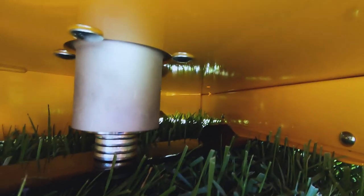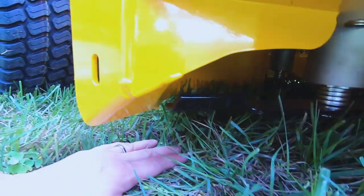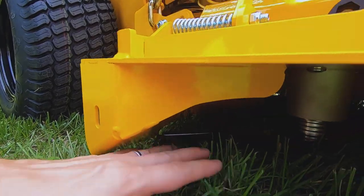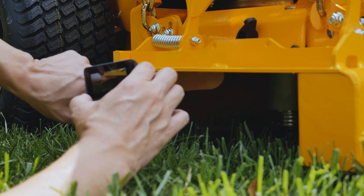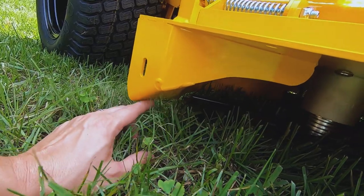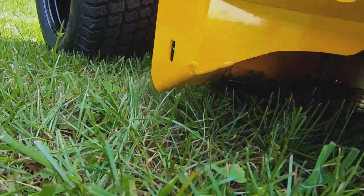It's also a lot easier to put a catcher on there. Inside the deck it's a very similar airflow to what we have in an AeroCore. The biggest difference is that the baffles have a bent lip on top instead of a welded lip — slightly different, same blades. We love to mount everything with round head bolts so it's easy to clean off under here and there's not much to snag onto. The back of our discharge opening has this piece which controls how much grass recirculates. It splits the airflow so we get nice flow out this way, then we're tapered back here, and there's nowhere for a little clump to build up. The grass steadily flows out without snagging up.